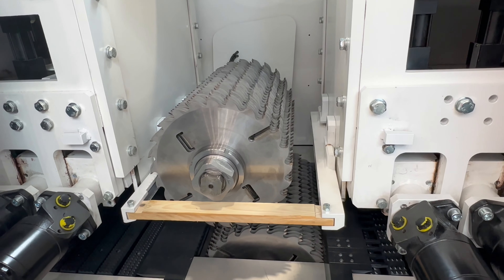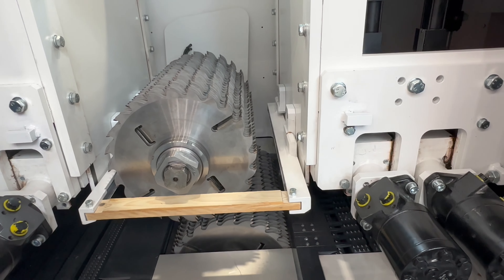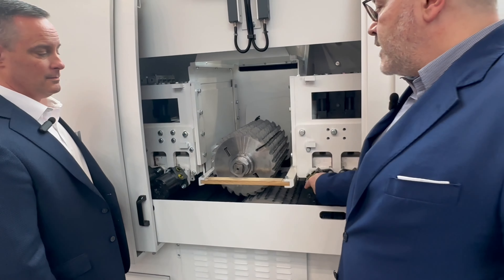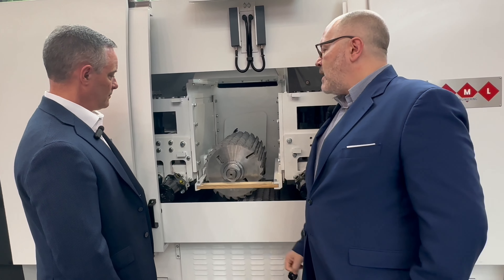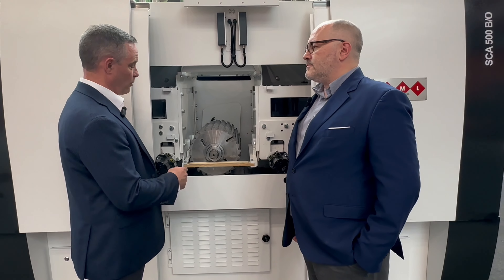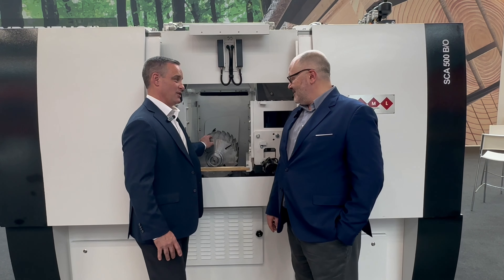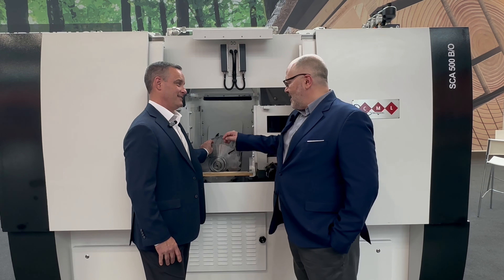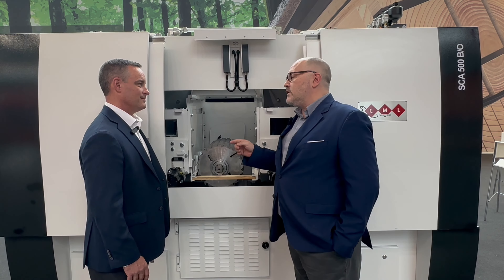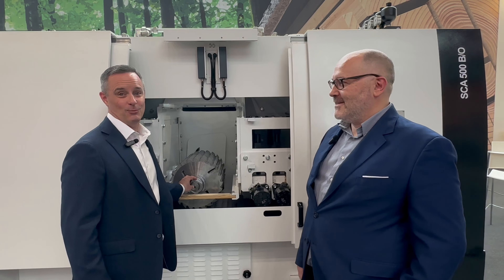So from my understanding, we can run a really thick board through there, and because we're using two blades that have a narrow cut on them, we're able to get more material per each cut. This is essentially the idea. This appears like it would be very suited for maybe the pallet or crating industry — is that typically where you see these? Yeah, that's right. This is where we are working. Hydraulic system, most power which is possible — we put a lot of effort on it. A lot of driving force, a lot of horsepower. Each arbor motor has 140 horsepower. I guess it can definitely get some wood cut, for sure.